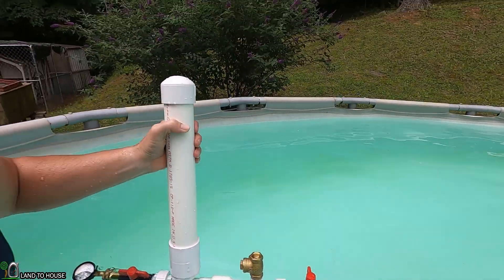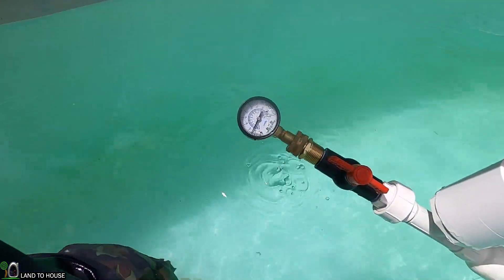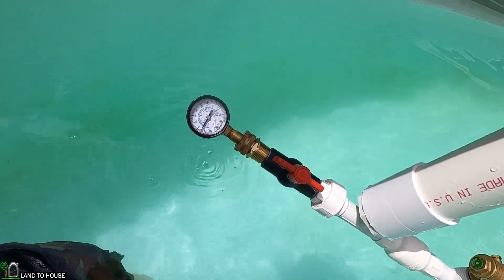Let me do one quick test to see if I can hold the pump more steady above the water and also hold the drive pipe to hopefully get a higher psi value on top of the water. I tried to hold the drive pipe and pump as solid as I could — still bouncing some toward my bucket — but the pressure is about 24 or 25 psi again. So it does seem like sinking the pump underwater is increasing the pressure in the same amount of time. Not the results I was expecting.